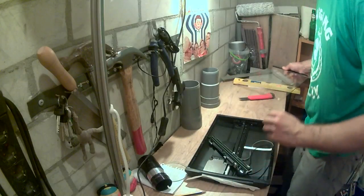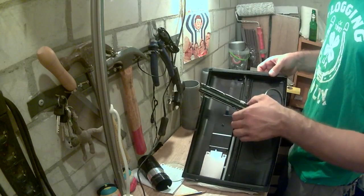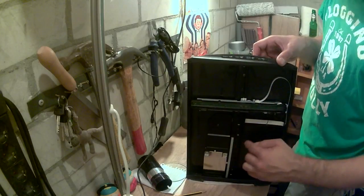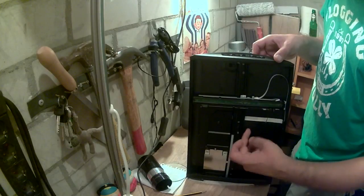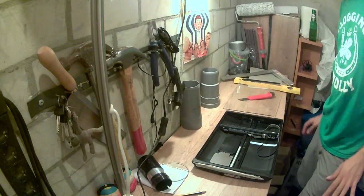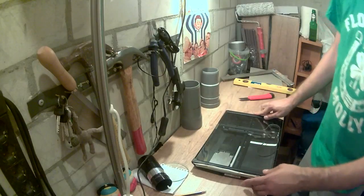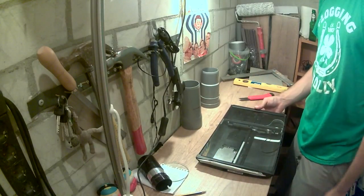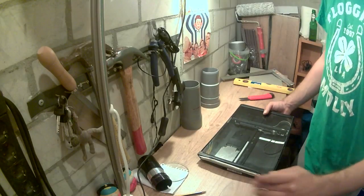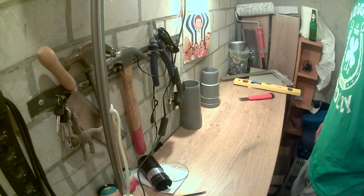Now this, by the way, is a good moment to show one of the issues I'm going to have to be working on eventually: the guide for the sensor has some trouble staying in place once it's put vertically. There's nothing to hold it in except for the gears, where the gear actually feeds. So slight agitation, movement, normal outdoor use will probably bring your camera to actually disassemble, and that's the issue I had when using it outdoors the first time in the cardboard box, that every movement I had to open it, go in, set everything back in place.